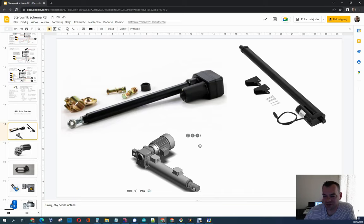I'm going to show you some examples of how it can be done. But remember, if you are building a Solar Tracker with up to 20 panels and your motor is using more than, say, 5 amperes, you have to think about the construction and how the worm gearboxes are working, because possibly it's too big. I don't think a tracker should take more than 2 amperes. We have a big construction with 20 panels and from the log analysis we see it is getting about 1.5 amperes. So if you build something and want to use big motors, our Solar Tracker controller can deal with it, but I'm sure that you can do it better.